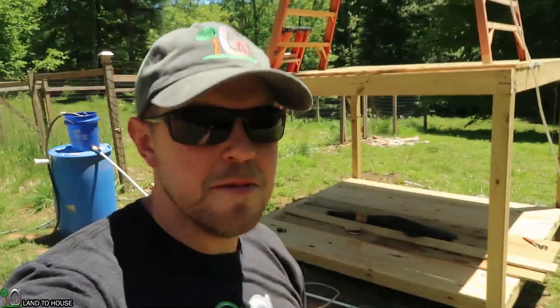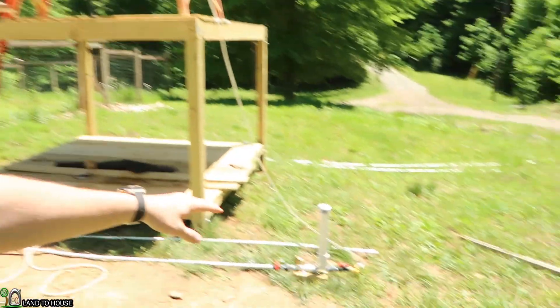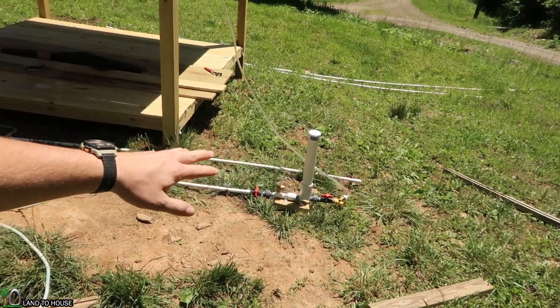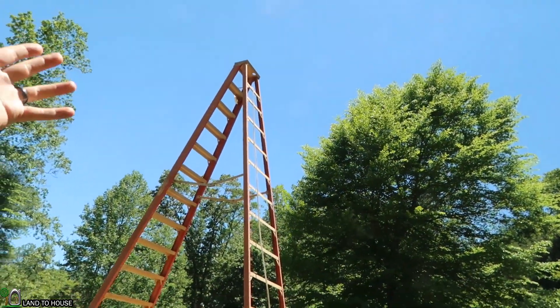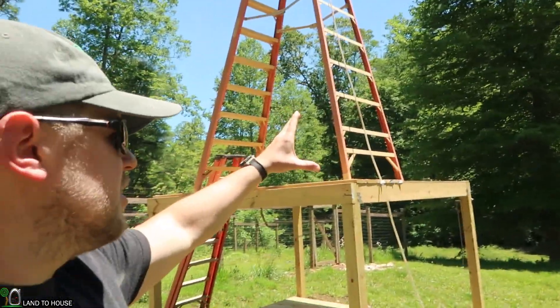So what is the concept here? If you have a certain amount of head pressure, it's going to make a certain amount of pressure in the pump. At this three-foot head pressure, I get anywhere between 25 and 30 PSI typically — a pretty good bit of pressure — and it has the potential to push water up somewhere around the 21-foot mark. But if there's not enough back pressure pushing down on this column of water, then the pump will push the pressure out too fast and it will stop.